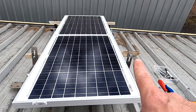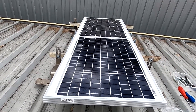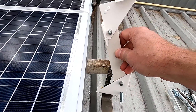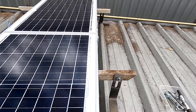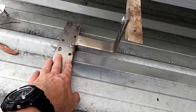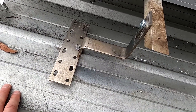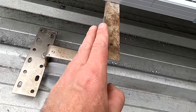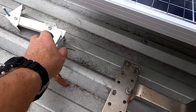You may have noticed I've put the solar panels at a bit of an angle - this one is all the way up and this one is all the way down, so they are a little bit on a tilt, not as much as before. I'll probably put these fiberglass extenders in again at some stage to lift them up a little bit more for extra power in winter time. This bracket situation is certainly not optimal - I'd like this support a little bit further back, but I'm trying to use as much material as I already have without buying new stuff, using screws, brackets, and aluminium I found on the property.